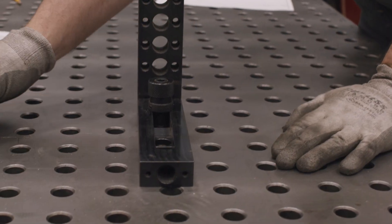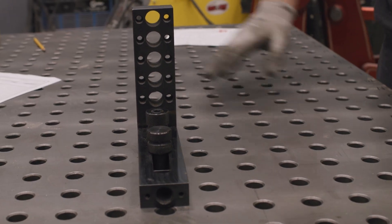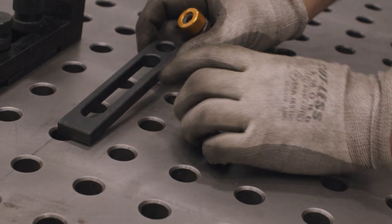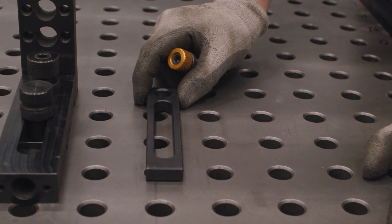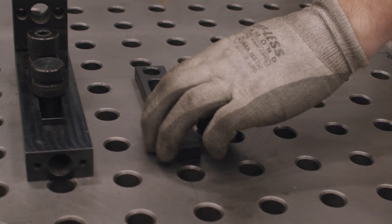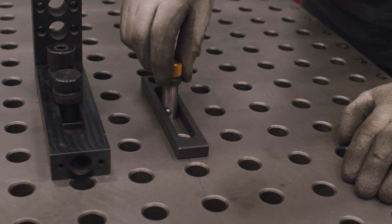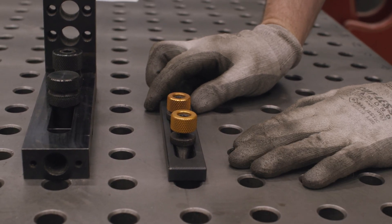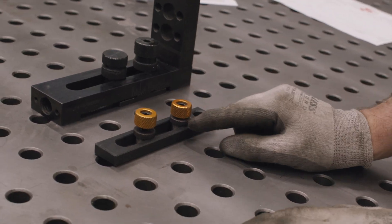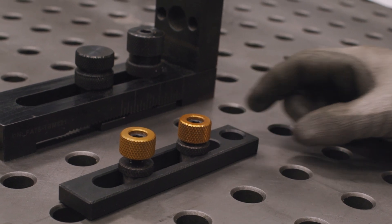To keep this from spinning, all we need to do is drop this pin in the second hole, and that squares the entire fixture up to the grid. Now you're probably saying you have fixtures that look like this — I call these infinity slots. Everybody thinks infinity slots are the greatest thing ever devised for a fixture table because you can move them anywhere you want. I would completely argue that this is the worst thing ever because it can move anywhere you want — when you drop the pins in, how do you know exactly where you're at? There's nothing to reference it from, and even if there are measurements on the side, there's nothing on the bolt to line anything else up with.